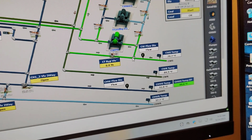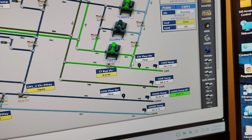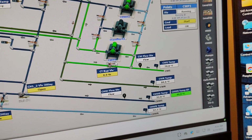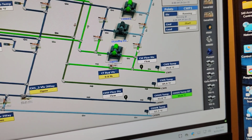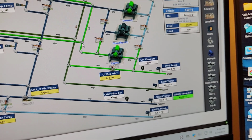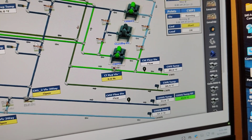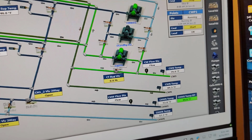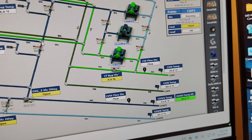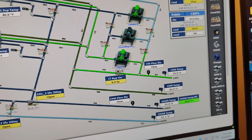So it's coming from the cooling tower. It is going to condenser water pump number 1. As we see, that's the working one. It is going like here, the condenser water pump, and it gives here to chiller number 1, and after this it will go to chiller number 2 to the condenser. After it finishes here from the condenser, it is going back. This arrow is wrong. This arrow is going like this here. It is going back. This one is closed. This is going back here in this line.